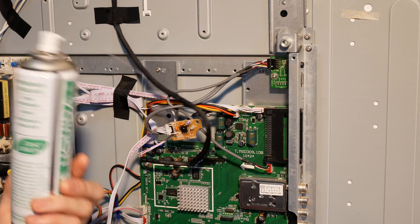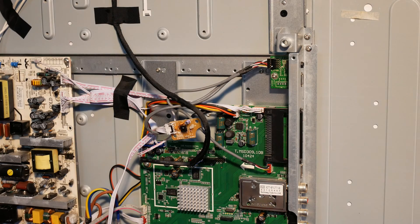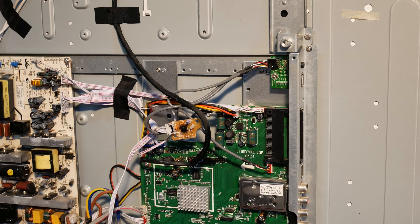In this case I already narrowed it down to the flash memory chip. When I cool it down it always works flawlessly. I don't know the physics that explain why this happens, but it's the third time I've seen this behavior in three different types of equipment and with flash chips from three different manufacturers.